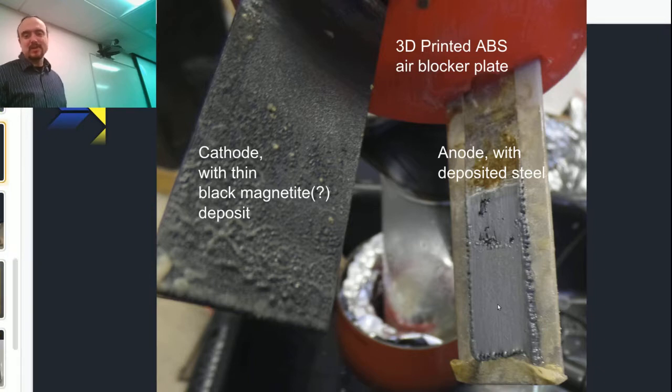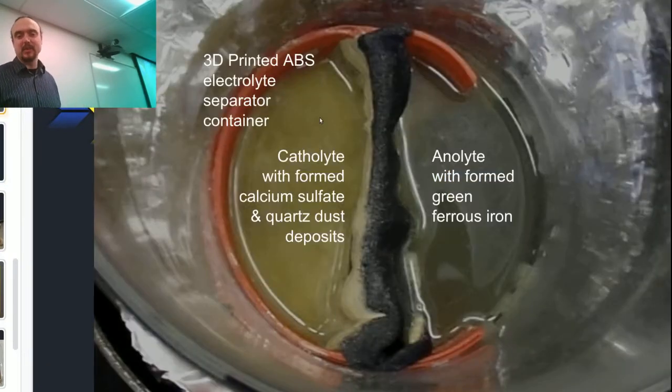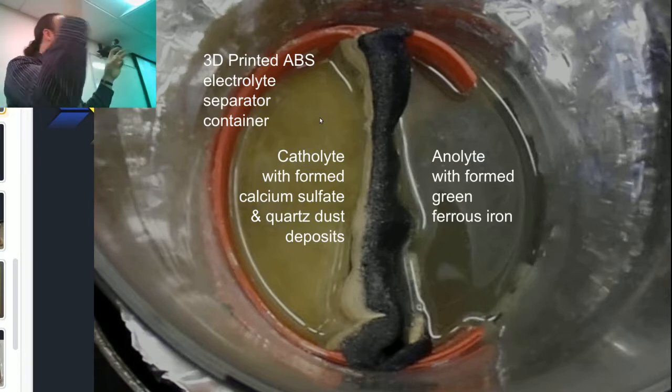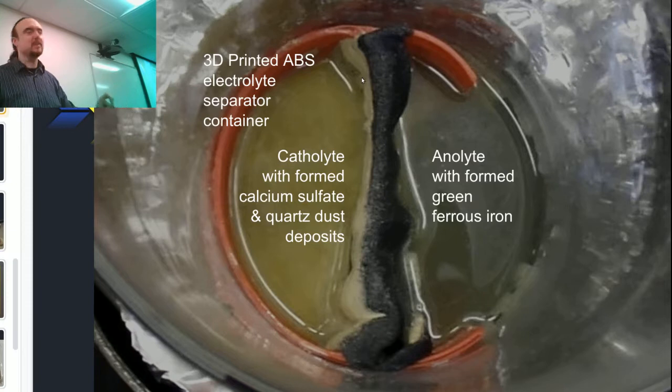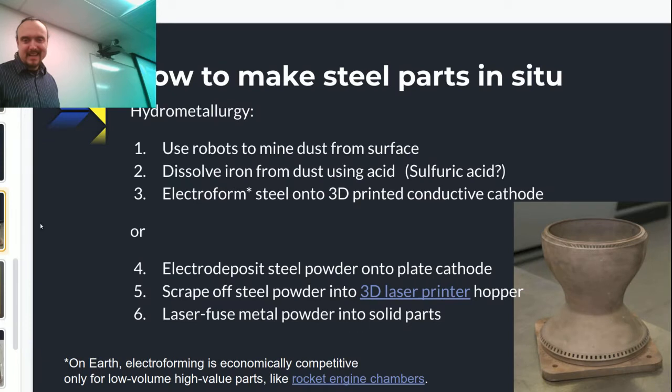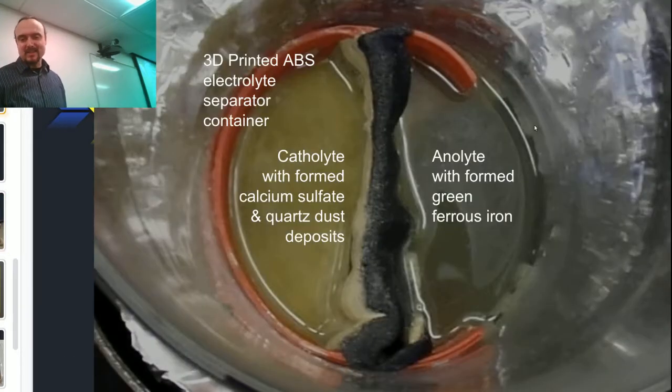Presumably if you tweak this more you could optimize it. I've been unable to duplicate this. What I was trying to do was run to exhaustion — the top layer of this is white, meaning I've essentially extracted most of the metals from the basalt, but at the bottom there's still a bunch of black material left. Ideally, to do this more scientifically, I would have X-ray diffraction spectroscopy — I'd know the elemental composition going in, the elemental composition of this weird white stuff, the elemental composition of the metal I'm depositing. I don't have that yet. But I was able to successfully electroform stuff literally starting from dust, which actually seems super exciting. This is so non-capital intensive — it's a Walmart jar with a 3D-printed thing to hold the electrolyte separator in place.